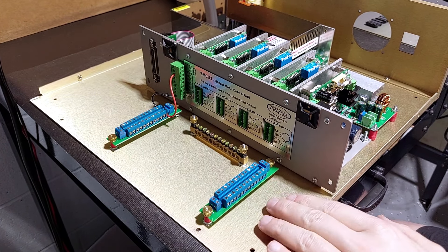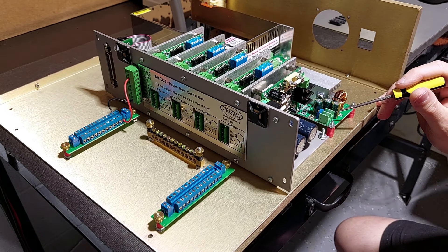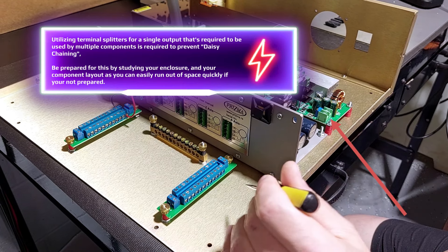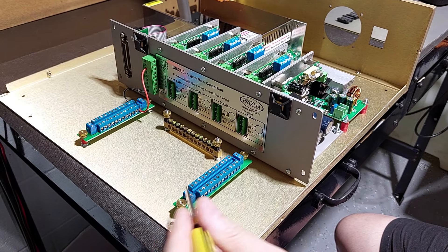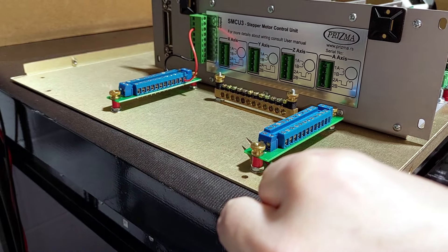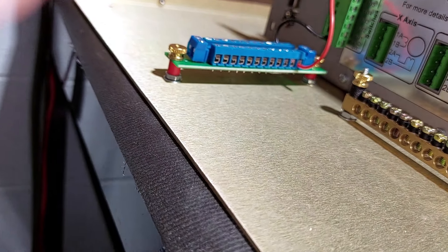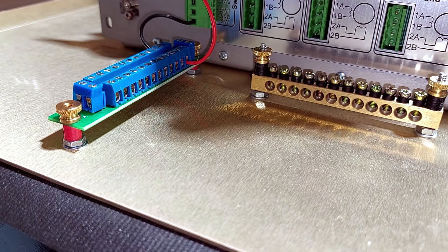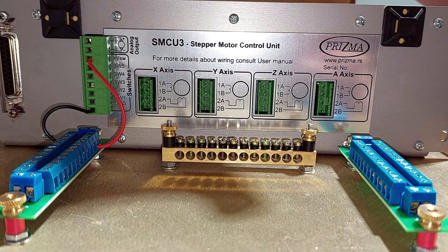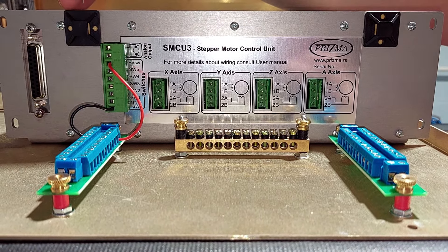The step-down output gives us 24-volt leads coming over to a split for power — required for switches and for our UC400 — so you only have one output. By utilizing the terminal split, you are not going to need to daisy chain, which again is not best practice. The toolless thumb nuts allow you to service this very quickly. I went higher on the standoffs so if we have to run wire underneath everything stays nice and neat.